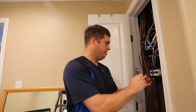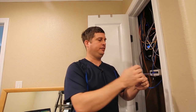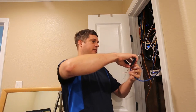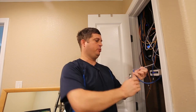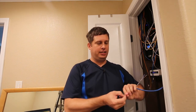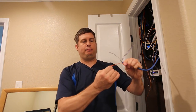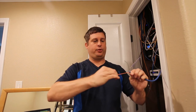Wire is cheap and you can always get rid of it. I'm just clearing the wires out of my way so I can get to the insulator in the center. The important thing is not to nick the cable. I'm using Platinum Tools Easy Jacks. What I do is take the wire between thumb and forefinger, pull it, then go one direction, a second direction, a third, and a fourth — that's how you get the wire straight. Then push it out of your way and move on to the next one.